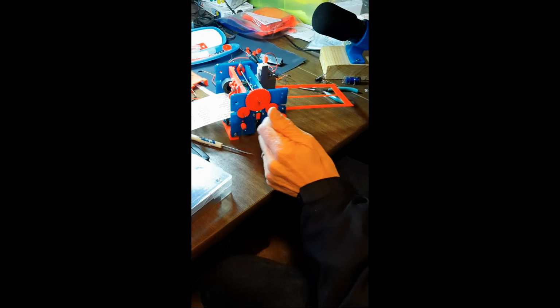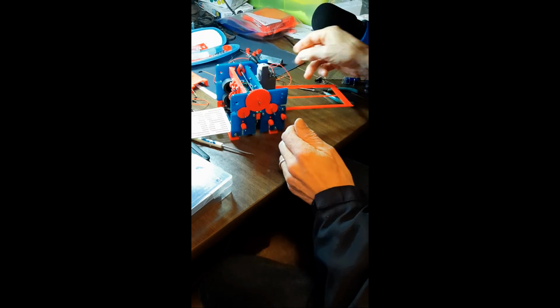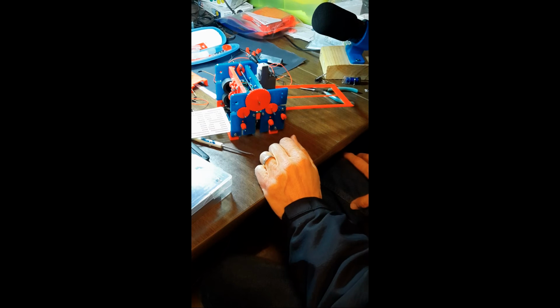So far so good. Let's put a card in. Oh, that's nice. Perfect. It fed in, didn't change the pitch of the motor at all. It tells me I've got the tension of the idler wheels adjusted right. It's enough to drag it through, but not so much that they're causing friction on each other and drag on the motor.